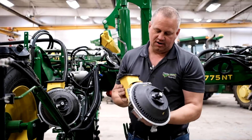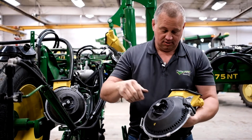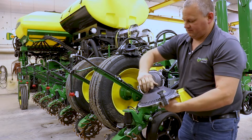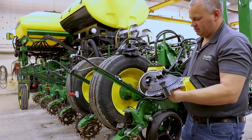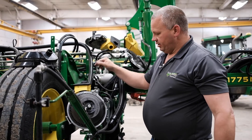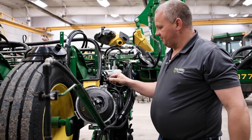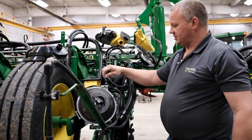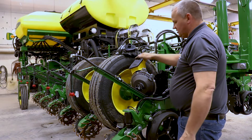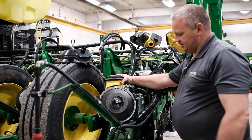I have this meter here and I adjusted it too tight on purpose. As you can see, it's pretty difficult for me to turn. Back to the meter that's on the planter here — I can turn it, but this is giving me a false setting for rolling resistance because the meter engages the motor and I don't want to be turning the motor. So what I do is unlock it and pull the meter away to disengage the motor.